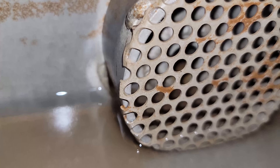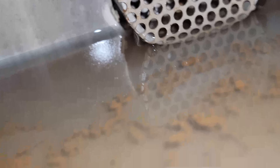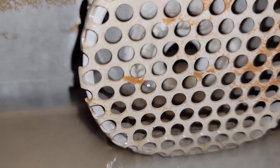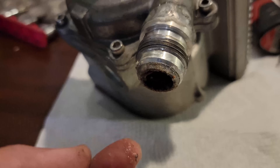I thought that big oval was the inlet, but on closer look there's this little tiny half-inch situation — technically you shouldn't lose prime at all with that, but I can't thread anything in there. This sucker should not be losing prime with it being that low, unless it's clogged up. I'm gonna loosen up all the fittings. There's some pretty heavy sediment here, which is concerning because it's an impeller — a centrifugal style pump that looks like a turbo. That sediment can eat away the impeller, and even stainless will wear down over time.